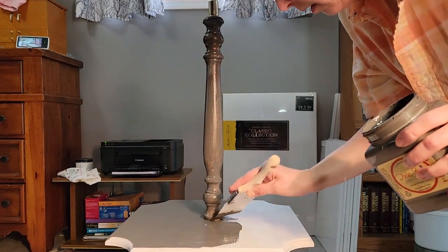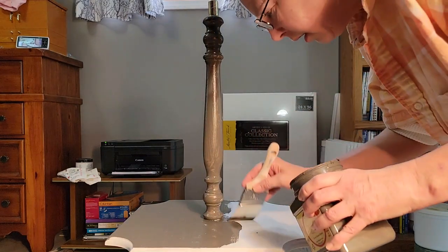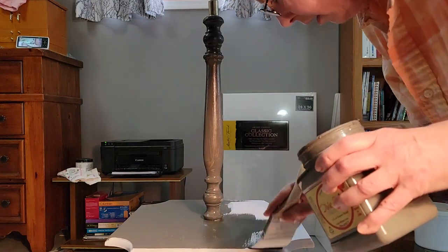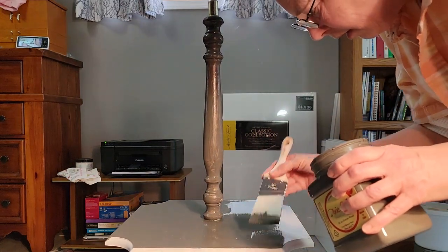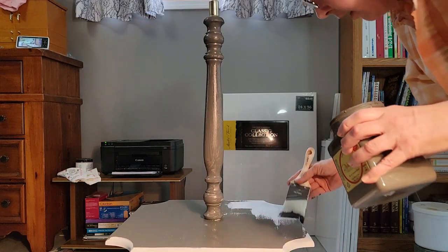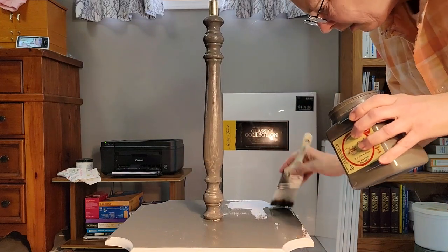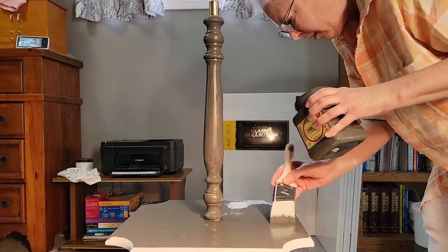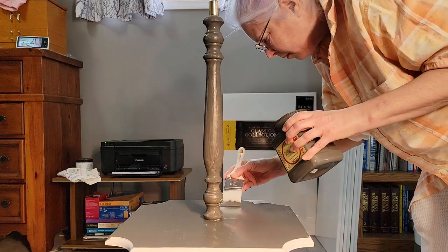And then I remembered I had swam, and I put on the dehumidifier because this is right next to where my small exercise pool is at, and it probably was at about 47% humidity, so it was pulling all the moisture out of the air. My paint was not going on very good, and it gave me lots of problems when I went to put my finish coat on, because I just put some regular polycrylic on it after I put two coats of the paint on, and I had a bit of a problem. You're going to see it here in a moment.